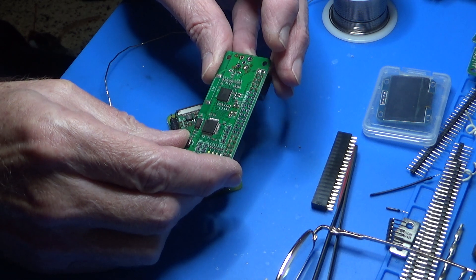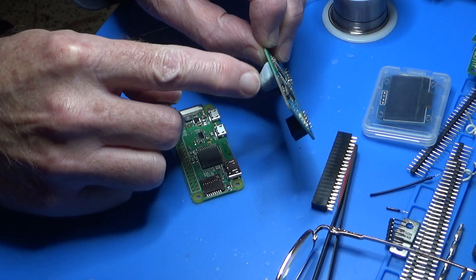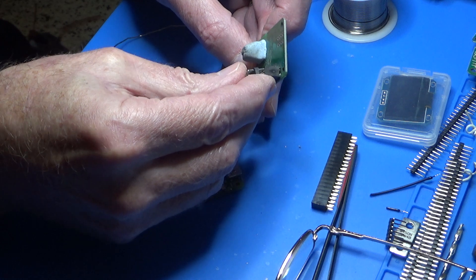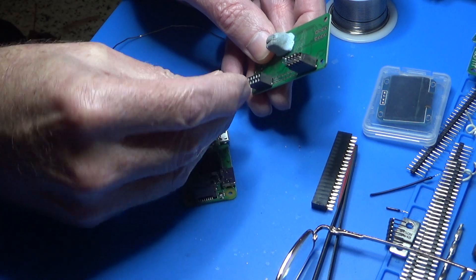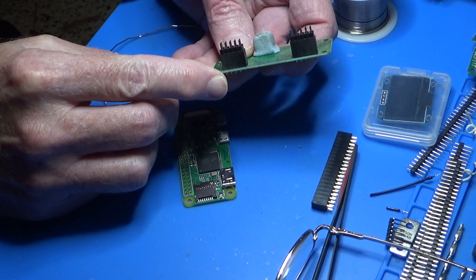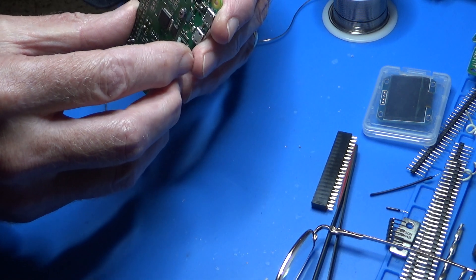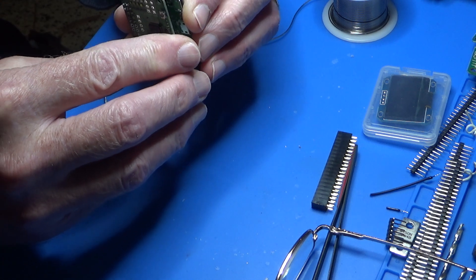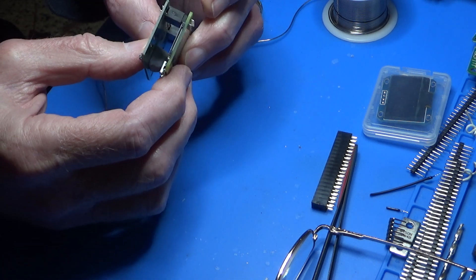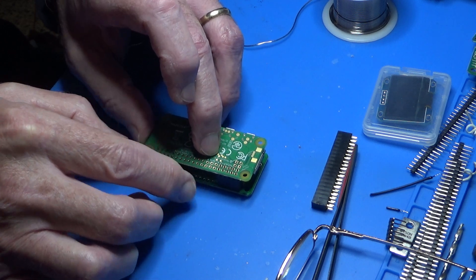This is an old dead modem board, but if you have a modem board you're using to build your hotspot, you can certainly use that. What I do is put the blob of bluetack on here — it's quite high — because I want the bluetack to press onto the Raspberry Pi. So I'll load the header pins — the long pins — into the headers there. Just make sure you've got them all in all the way, then I mate these two together and just push down on the bluetack, make sure the boards are square, the distance here is the same, and then I just flip it over and I'm ready to solder.